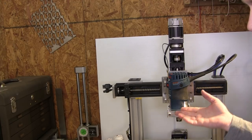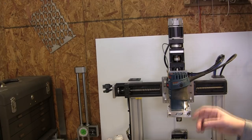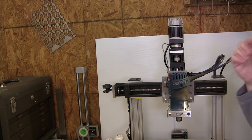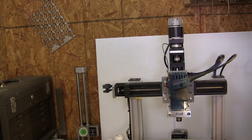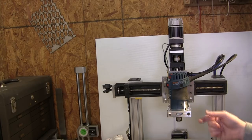I'm going to go ahead and put the Teknic motor back on it for the X-axis, left or right, and we'll crank it up, and I'll run it through its warm-up program, and you can listen to it. You can see how quiet it is, because you won't hear the motors as much as you'll hear the machine just moving. The ball screws, the bearings that are in it, it's quite something to see, especially the rapid. So let me button it back up, and then you can see what these can do.